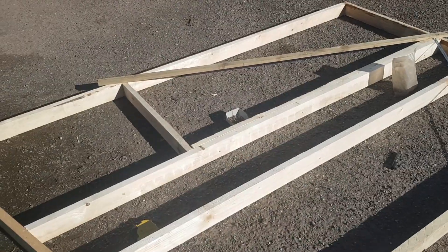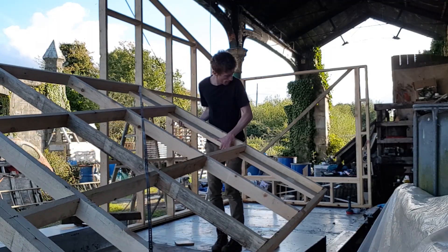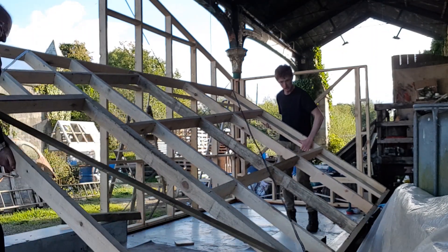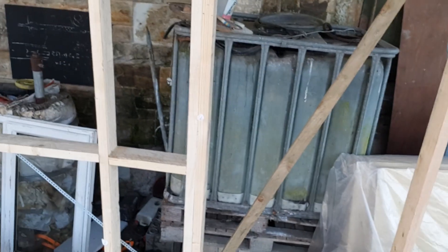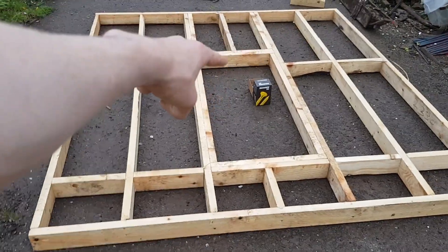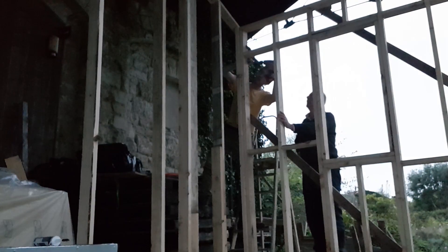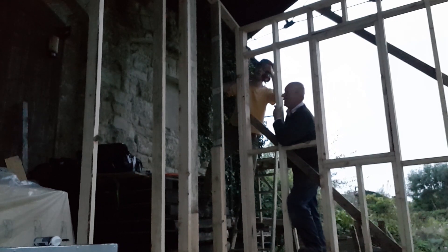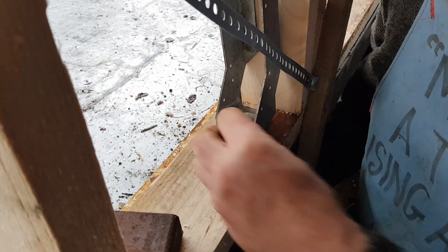This is day 3 of framing. That's the door frame — we're still going to put in a full-size header over the door. End of day 3 and we have 3 walls up. They're kind of large and tricky to work with. This is my door. Update, day 4: this is the back wall — that's going to be the window for the bathroom. We fastened the timber frame to the trailer using M10 bolts drilled through the trailer frame, through the floor, the base plate, and then screwed to an upright.